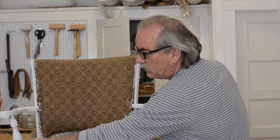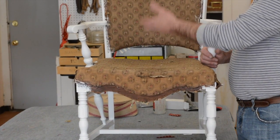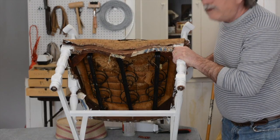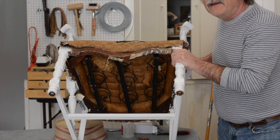This is a saddle seat, and springs should not be on a saddle seat because a saddle seat shouldn't look like a saddle. When you add springs, they tend to belly it up in the middle and that's not what you want. So I'm going to show you how to remove these springs — which in my opinion is not a good system — and then change it to a polyurethane seat.